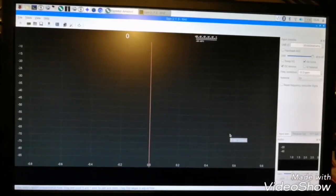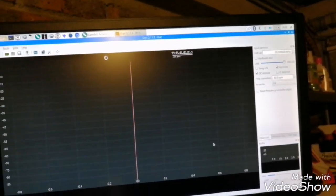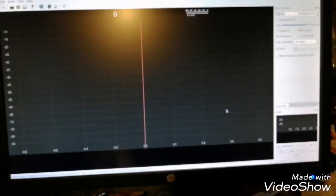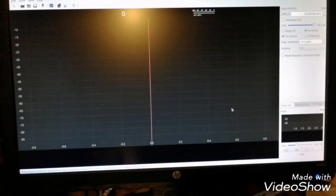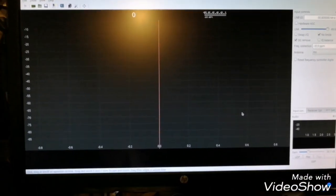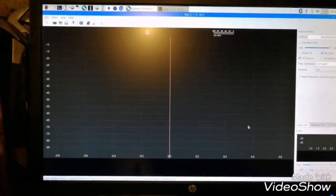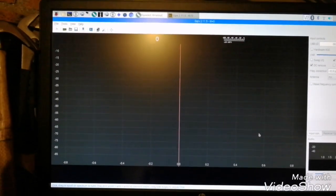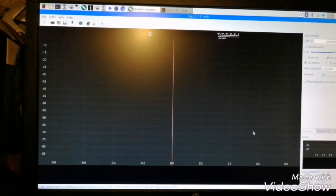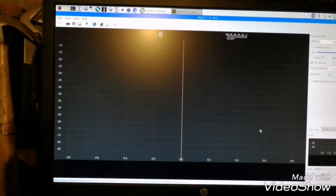Just to rewind about what I said before: the SDR is connected at the back with an SMA plug, and I tap the SDR from the circuit board on the UBTX. This point is the 45 MHz IF — it's the output of the 45 MHz IF mixing.